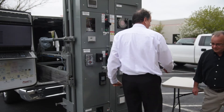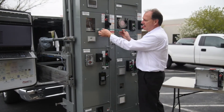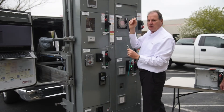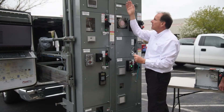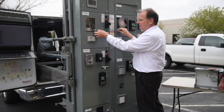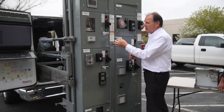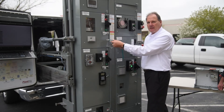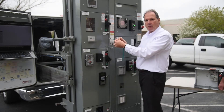Looking at how we connect the IntelliCenter MCC, we utilize Ethernet. This Ethernet cable connects into the motor starter and is fed up through the wireway into one of our switches. A switch can be located anywhere within the MCC — in the top wireway or in any of the buckets. With intelligent devices connected on Ethernet, whether a VFD, soft starter, or motor starter, I can collect all of that data, run it through IntelliCenter software, and gather all the information however you want to use it.